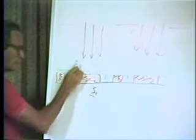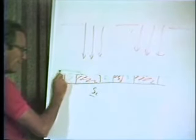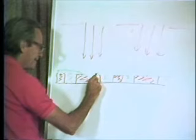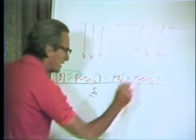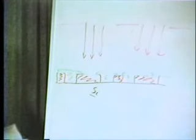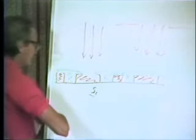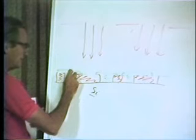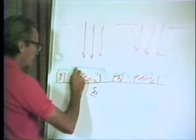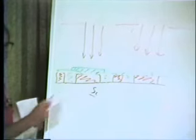But then, again, with a resist and so forth, pieces of it are dissolved away, so they can get little caps and so on, and make more insulator in various layers, each time deciding where the stuff goes by using this photoresist trick. And they're ultimately building up a metal connector, finally, with the same general idea. Let's say metal is put across from here to here. So now we have two transistors connected together.